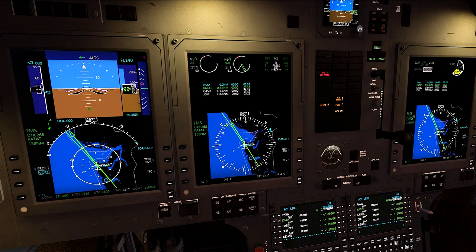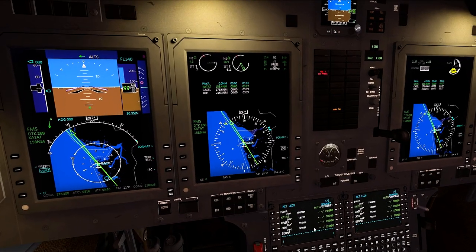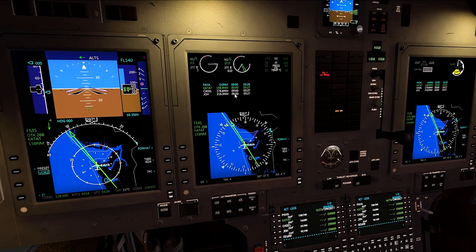And we've got N1 down here. Add fuel back up here. N1's coming up. Oil pressure is rising. Watching for a light. There's the light. Monitoring the ITT. Oil pressure still coming up. N1's rising. And oil pressure light went out. We've got two good lights there.